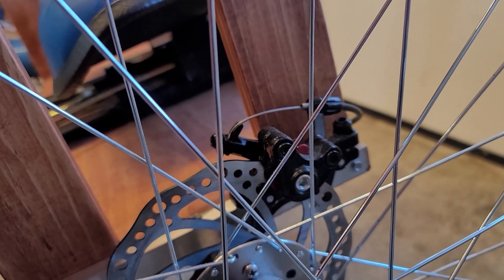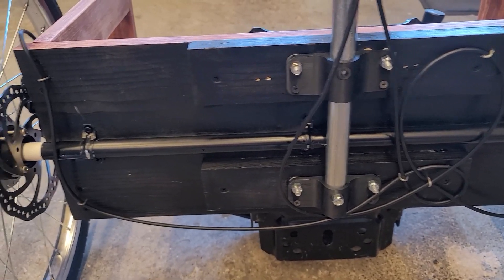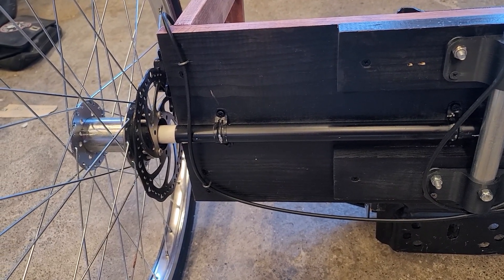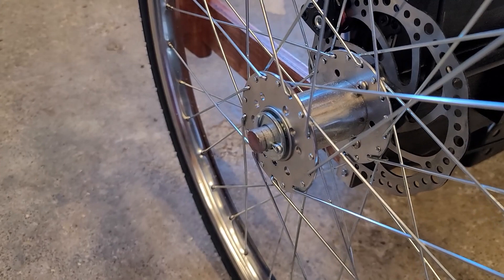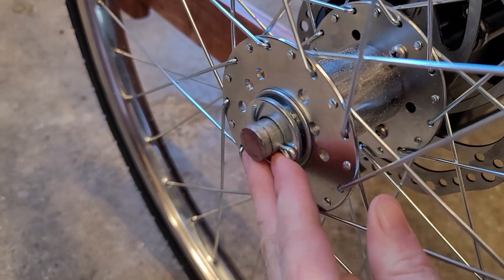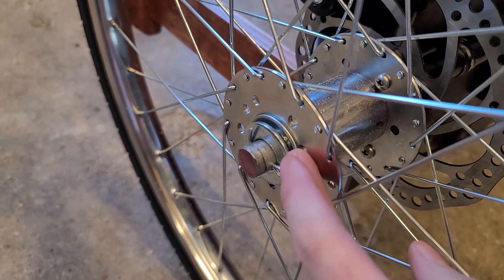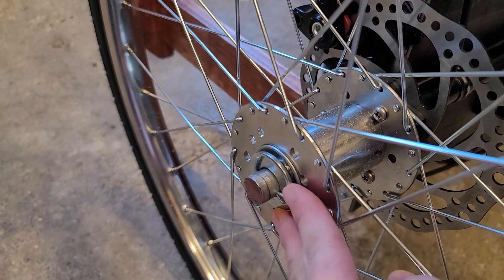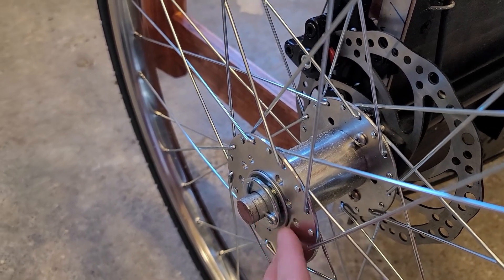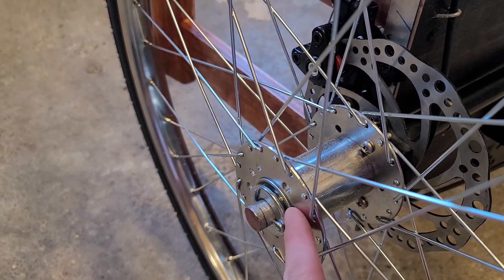I have put aluminum edging on the board and then you have to get an adapter to mount the brake coupler, but you're going to have to modify that — you have to saw off part of it and drill holes to be able to screw it directly to the board. On the bottom, the axle is a 5/8 inch solid steel rod that goes through. You need to drill holes to put stop pins in and then you need washers to make sure everything stays evenly spaced and rides smoothly.